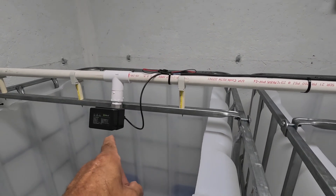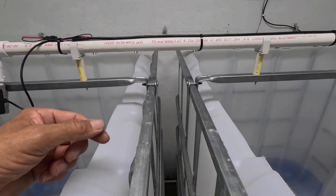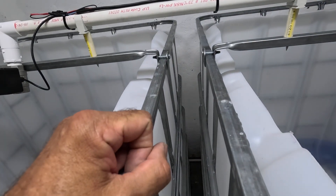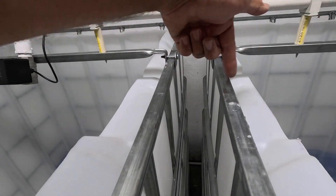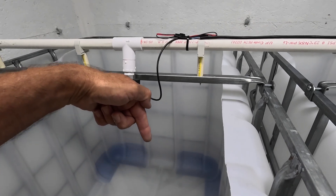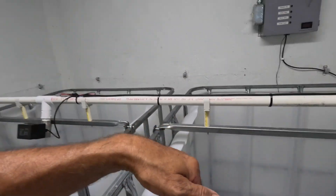If you don't want to put in the ball valves and complicate things with a float switch and everything, you could just drill a hole down in one tote, a corresponding hole in the other tote, and add bulkhead fittings or uniseals with a piece of PVC pipe between them. Then as the level rose in one tank high enough, it would automatically transfer through that pipe and start filling the second tank. Simple is good — but sometimes I just have the need to put my own spin on it. I like to build stuff, so that's why we did it this way.